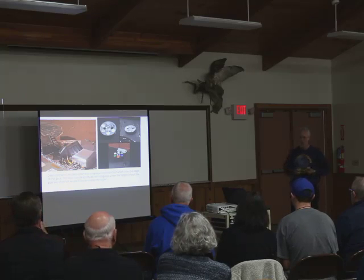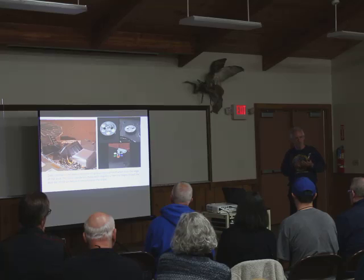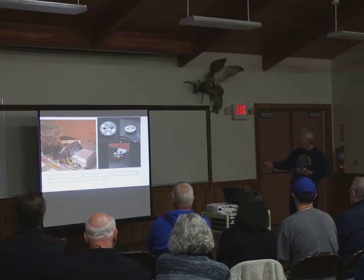This is how we do color calibration. We have a monochrome CCD, and we have a color filter wheel to calibrate everything to make sure you get an accurate color image on Mars. We have color standards on the deck. Here's one of them on the corner of the deck. This is what it looks like in a full color picture.